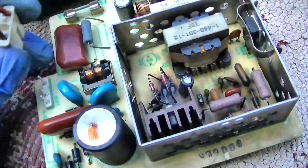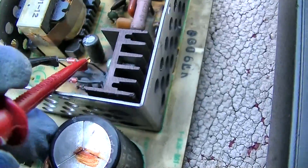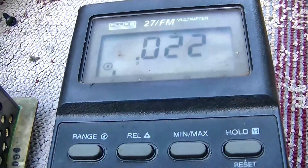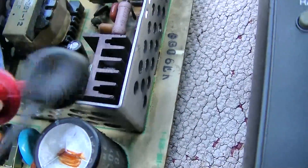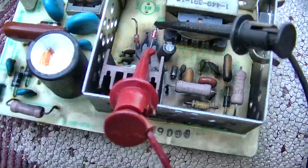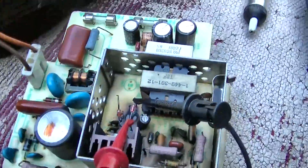I need to go back and watch my previous video on this. It's like the diodes are running so hot. Yeah, that sucker is shorted. I think they were in parallel if I remember right — yes, they are, they're in parallel. So one of the two has shorted again. I pulled both of them out and measured them. This one measures 0.6 volts one way, open the other, because I only have a 2 to 2.5 volt diode meter here.